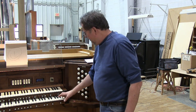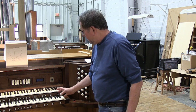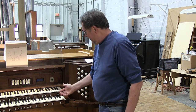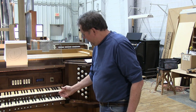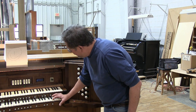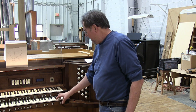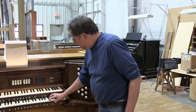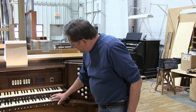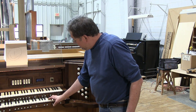Wow. We finally get them all together, and we put them on the keyboard, and they have different kinds of contacts to send the signal out to the computer. They all have to fire at exactly the same time. When this one comes down and sends down that signal, this one has to come down exactly the same. And then they have to have the same kind of feel. We run through a variety of things where we have them stay up with 4 ounces. We try to do a thing called a tracker touch, in which there's a little bit of resistance at the very first, and then it'll just open up and fall. So it's called a tracker touch, and usually we adjust them twice.